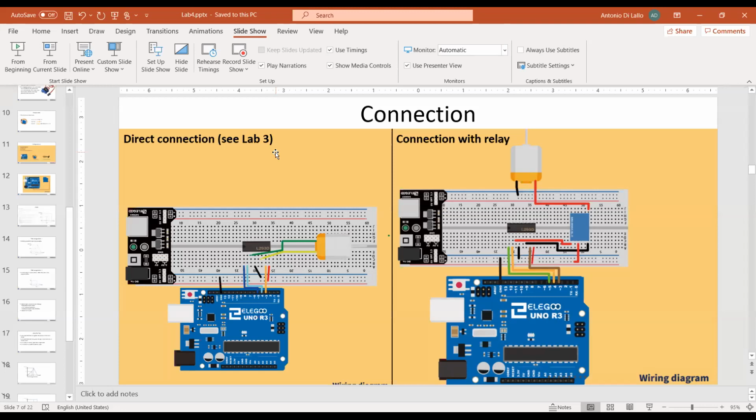I mean, one way, for example, is you can first set the speed to 128, which is half speed, and wait for 1.5 seconds using the delay function, and then change the number to 255, which will enable full speed rotation, and wait another 1.5 seconds. So this is very rough. You can create a much smoother speed up or speed down by adding more steps. Currently, the method I just used is only 2 steps: 0, half speed, and full speed. But you can add more steps into it, like a quarter speed, 3/4 of the speed, this kind of thing. Okay, I got it.